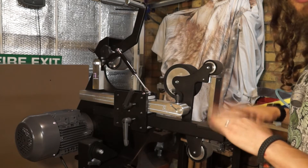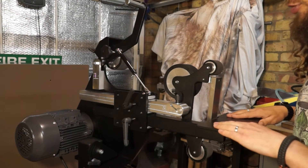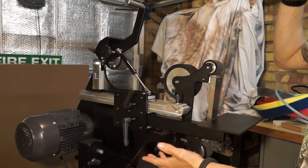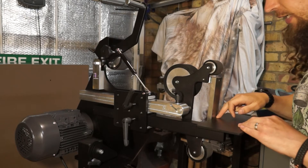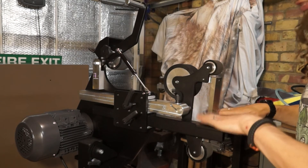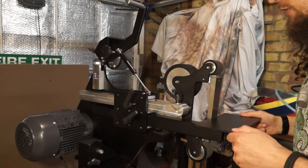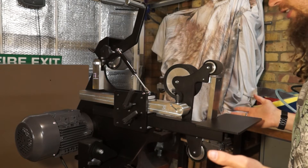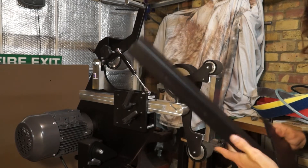Starting with the plate — this is the basic flat plate that comes with the grinder, with the same powder-coated finish as the rest. The arm is a hollow steel arm, whereas the platen arm is a solid aluminium arm. There's a slight weight difference but not a massive amount in it. With the plate there's a really nice recess that goes beyond the belt, so if you're grinding something and it goes past the belt you've got a little bit of support behind the platen — it just wraps around the belt nice and snug. It's a decent size, pretty thick, with nice long arms so you've got plenty of adjustability.